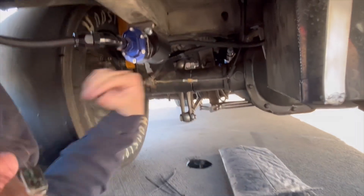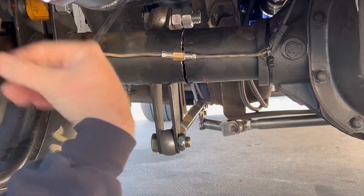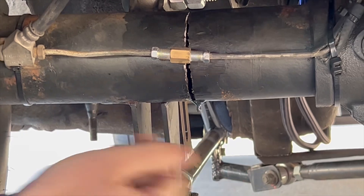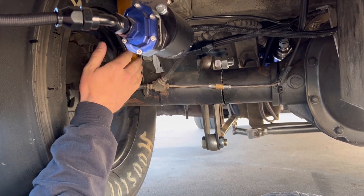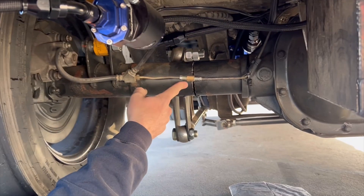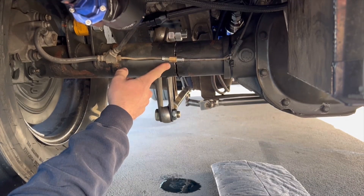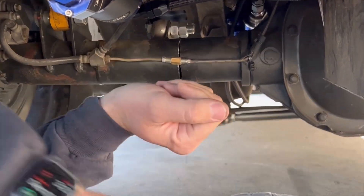I felt a little crazy on the leave. And as you can see, the tire axle tube just cracked. So that's going to be where I welded it with a MIG welder. All these bars here, all these brackets are done with TIG — I TIG welded all that, so it's a nice deep penetrated weld. But this one I did with a MIG and I honestly, I've regretted it ever since. And now I regret it even more. But that's what happened there.